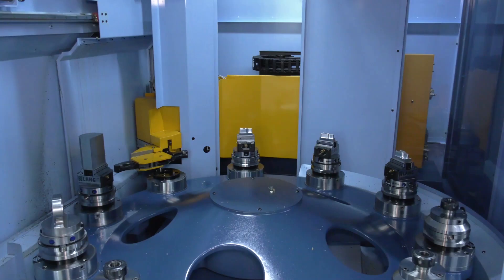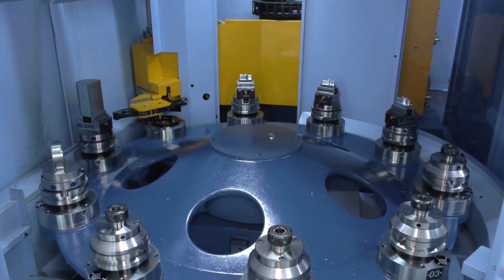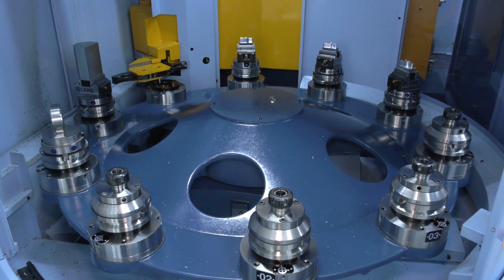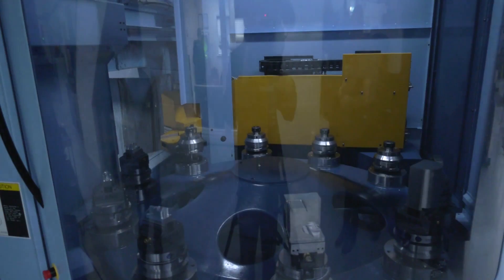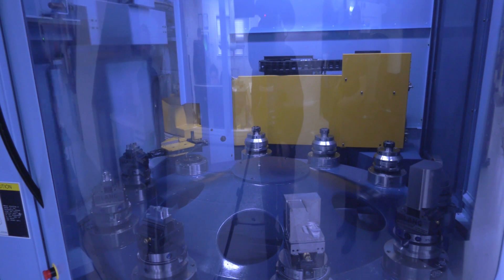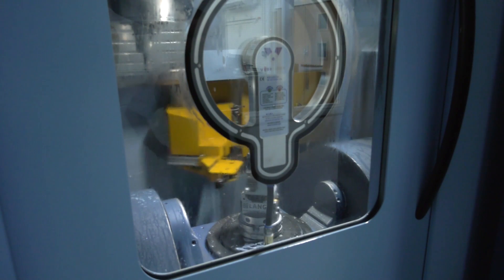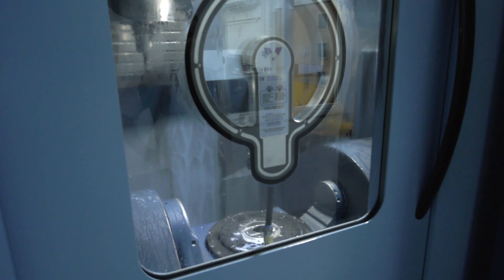What about this setting area? They really have thought a lot about how to lay this out — would you say that's impressed you as well? Yeah, just the 10-pallet table. On some other machines you can only have one pallet in your loading bay at a time — you load it, ready it, put it away, then call another one out. It's a long drawn-out process. With this one I can ready three at a time, probably load four at a time. It's quick and easy, and you can see it all. If you ever have a doubt that you've done something slightly wrong, with this I can see what I'm doing, relate back to the control, it tells me what's going on, and it just gives you the reassurance to leave it running overnight.